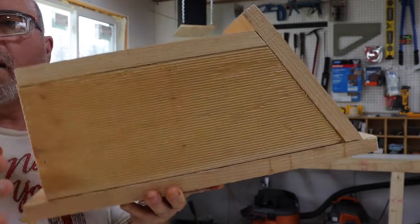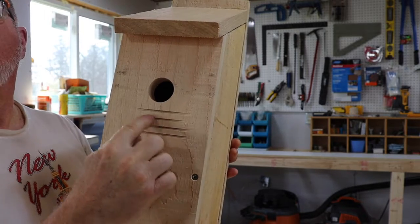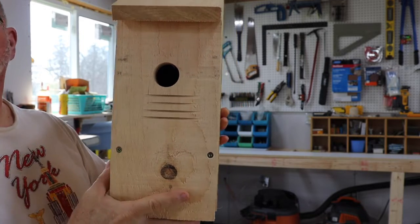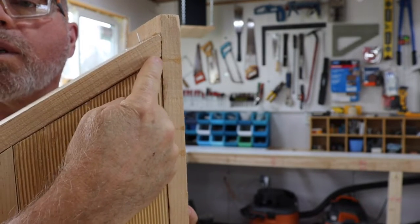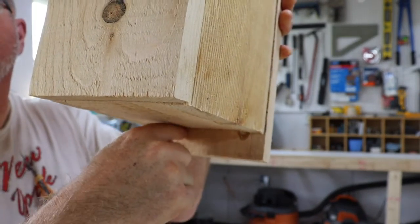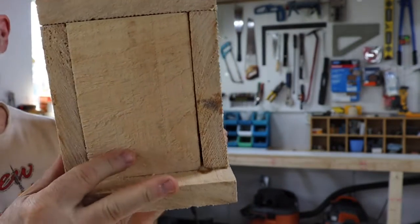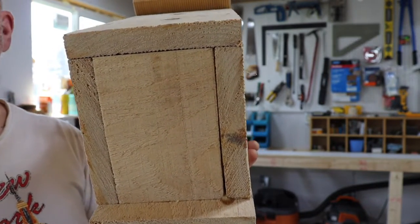This is what the finished product looks like. It's got a specific size hole for a specific type of bird, and a little perch for them to grab on when they go into the hole. The hole is a certain distance from the bottom inside the box, which attracts certain kinds of birds. It's got a nice sloped roof — notice the cut is on an angle to meet the roof, the roof is also on an angle to shed water, and there's a small lip on the top and bottom to put screws through when mounting it. I'm also going to put a couple of small holes through the bottom to allow drainage in case any moisture gets inside.